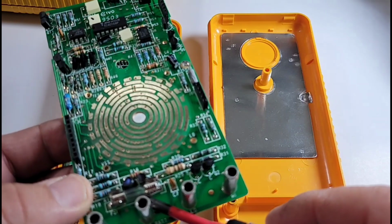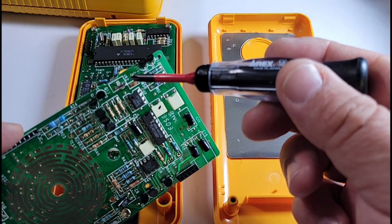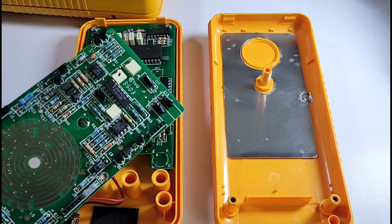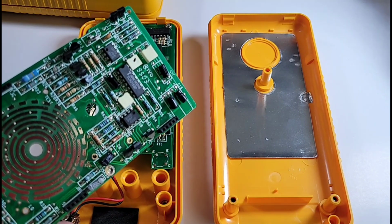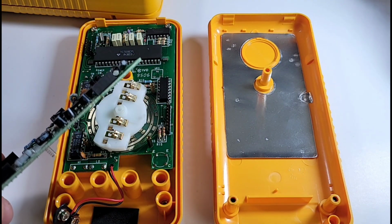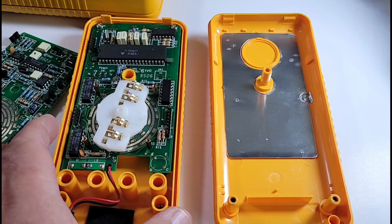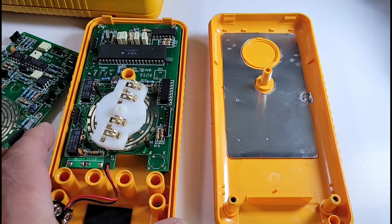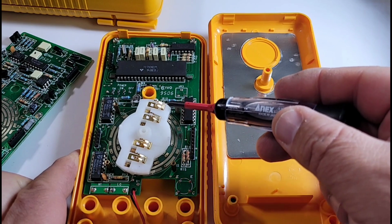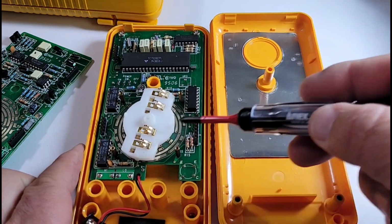There's our 250 volt fuse, 250 milliamp. And over here we have VR2, so a trim pot for user configuration or calibration if the case ever arises, but very nice. And look at that size, the thickness of that PCB. Good quality thickness, excellent. Powered by a 9 volt battery, you can see there are the connectors for that. And wow, look at those tracks for the selector switch. Big honking tracks with claws like a raptor.